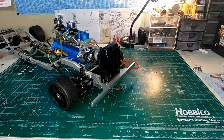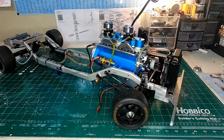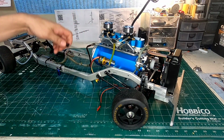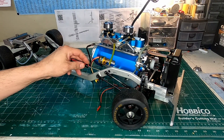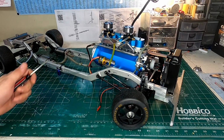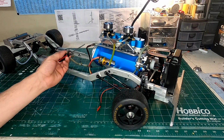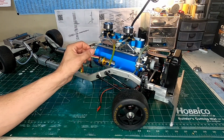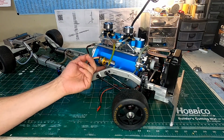Now this uses a wet starter. Because it uses a wet starter, the gear drive turns the flywheel and the starter gear, and that picks up the oil. And as it's picking up the oil, the oil comes out and fills up that area again with more oil. Pretty soon you start filling up that area with more and more oil, and now that oil is going into the starter motor itself. Now what I've done instead was close that area off.